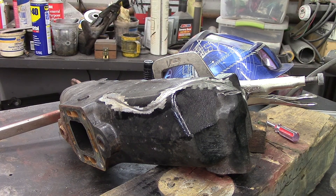As soon as the welding is done I will go on with a post heat to relieve the stress. Then it will immediately go into fiberglass insulation and stay there for several — if not six to eight — hours. I cannot stress enough that you need to have everything set, prepared and ready to go on this. If you leave it cool between welding sections you will hear it snap and crack. That's recracking somewhere else, possibly in the heat affected zone or outside of that, wherever the cast is the weakest.